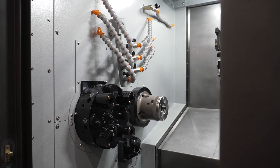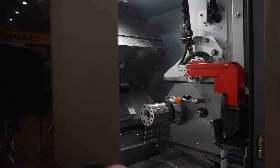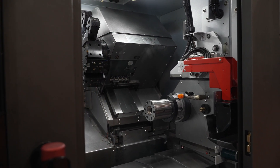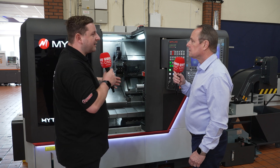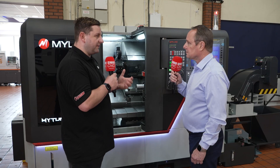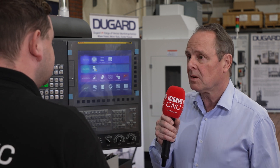I'm glad you've gone on to bar work because there's something quite strange in there — you've actually got a tailstock as well. Yes, that goes alongside the sub spindle so you've got the option if you need a long shaft to be supported — you can initially support it there and then subsequently use it in the sub spindle. That must really help with bigger bars, you can keep it supported all the way through. Yes, exactly — with the weight of bar and so on you've got a lot more support there.